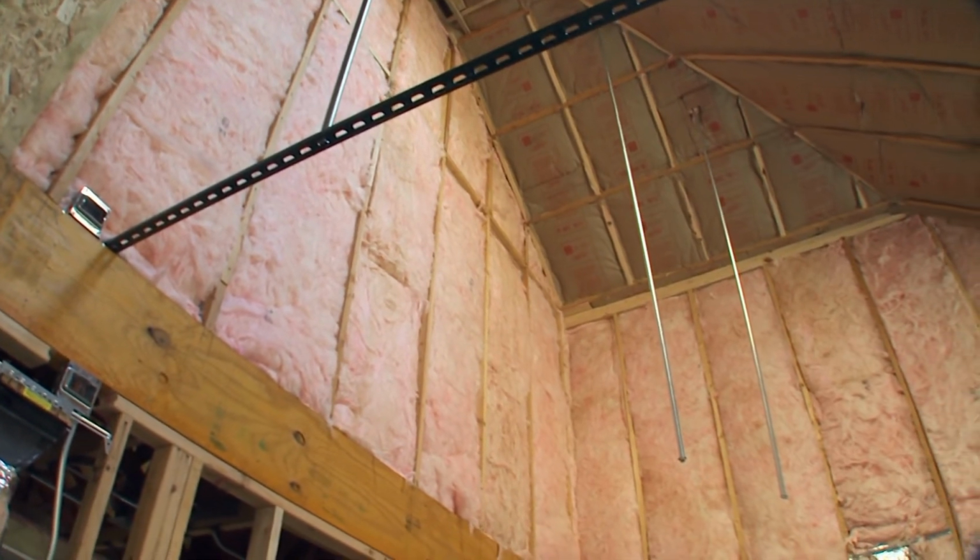Yeah, and I think, within the last 10 years and certainly within the last 20, there's been a huge evolution of products. Go back 20 years and everybody's concern was bulk water: I don't want my building to leak. So we put up tar paper, which controlled water, and then you clad it with some sheathing. Then gas got expensive, so everybody said, let's throw some insulation in the wall, and that seemed to be working pretty well. And then, now we've got to make it tighter, and all of a sudden they thought they had it solved, and we ended up with a whole bunch of problems because we didn't quite understand the science of what was going on, vapor movement and water intrusion and allowing that wall to dry at that point.